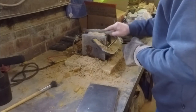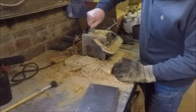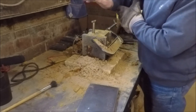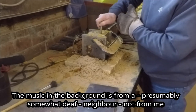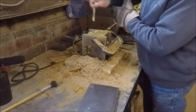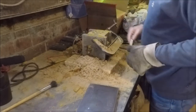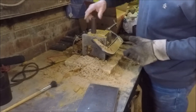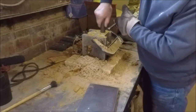I scrape the top off, and then I cut a hole in the core because these cores are very hard to get out of the die. I've got to wait until the sand's just gone off a little bit to do it. Without this hole it's very, very difficult to get the core out of the casting after it's made — it's difficult enough with this hole. That's one of the reasons I only use a two percent sand for most of my core work. Now I need to smooth up the end a little bit just to neaten it up and compress the sand on the bottom so that it's got some strength.